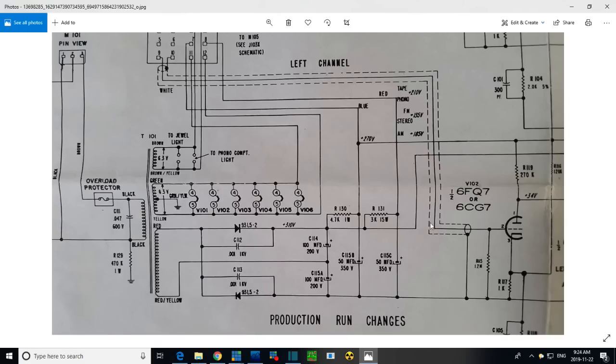Let's go back. Okay, same line is this one. And all the filtering that's on that line is these two guys here. Pretty large, 100 and 100. My little additional 50 may not be enough. I think these guys are the guys that need to be pumped up. So what's happening here is you have your classic filter come out of the rectifier, reach some filter capacitors, then through a large wattage resistor to meet another filter capacitor. So there's the pi happening. And then this signal is sent off to parts unknown in the radio, in the amplifier and receiver.